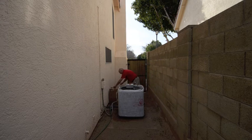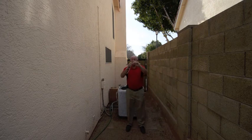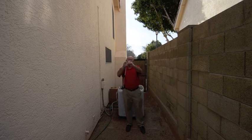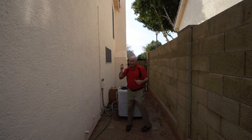Now take your 3 down tubes with your misting nozzles connected to them, and again this is a push fit system. I'll come a little bit closer to the camera for you so you can see that when you push in, that's nice and secure. There's what's referred to as a collet here. If you ever want to take it apart, you hold that in and pull it apart. That's how easy it is to do.